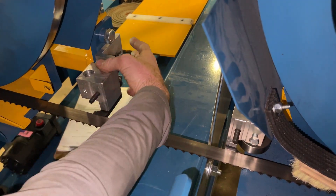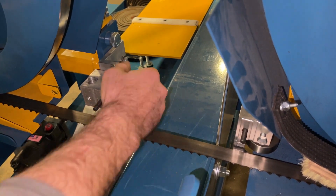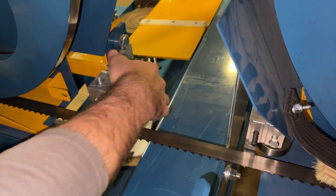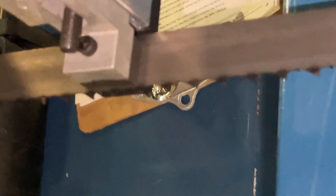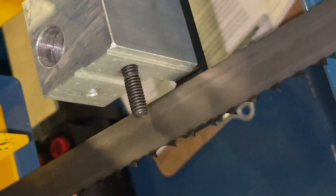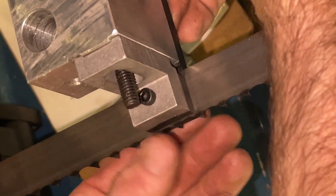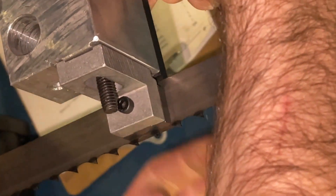I'm going to put pressure down on this L-bracket and try to find the distance we want. What I mean by that is we want this bottom foot and top foot to be riding on this blade evenly as it runs. You want no more than a sixteenth — if you can get a good shot on that. That is about perfect, that's all you want.